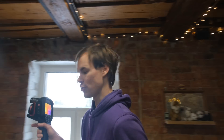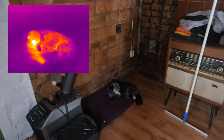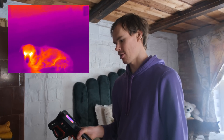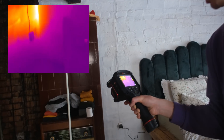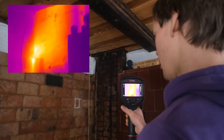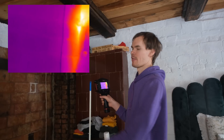Let's check out our bedroom. Here is a thermal image of Keita — she's showing 35.8 degrees, so about 36 degrees. It's pretty accurate for getting a body temperature, though a bit less than a thermometer would show for an animal — her body temperature is probably 37 to 38 degrees. You can also see the chimney itself heating up our room. The heating wall is currently only at 20 degrees and the heat is going straight out into the chimney rather than warming the wall — that's for safer burn when we don't have good draft.